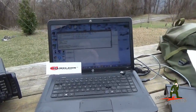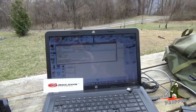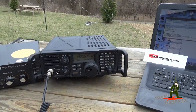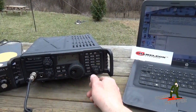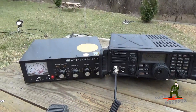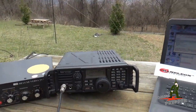We're all set up here. We've got the laptop running RMS Express. We pulled up the station we're going to connect to — Victor Alpha 3, Lima, Kilo, India — up in Canada from the mountains of West Virginia. The laptop is connected to the SCS modem, and the modem is connected to the IC7200 HF radio by ICOM. We've gone in and checked the settings to make sure data mode is on, and we've turned the power down to 50 watts because we're running data. The radio is connected to the MFJ VersaTuner 2 in bypass mode, so we're only using the meter to check the SWR. Let's go ahead and call out to that station in Canada and see how it does.